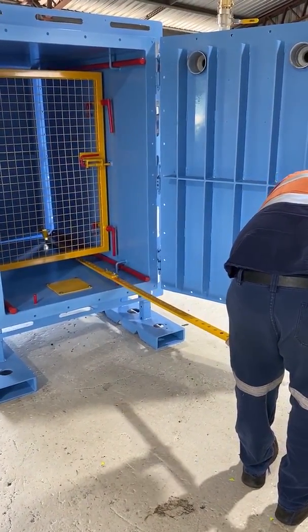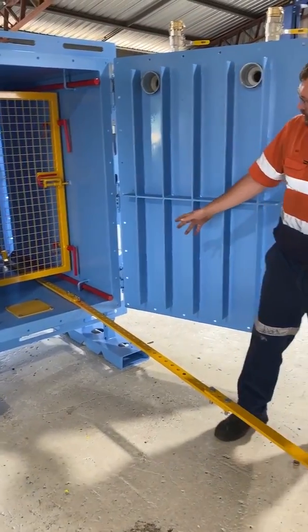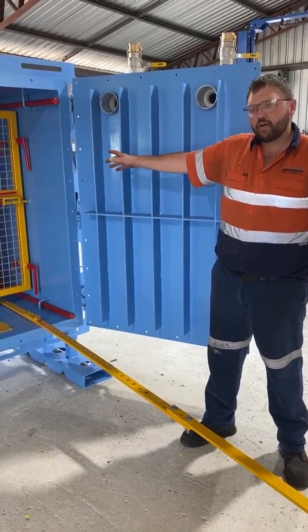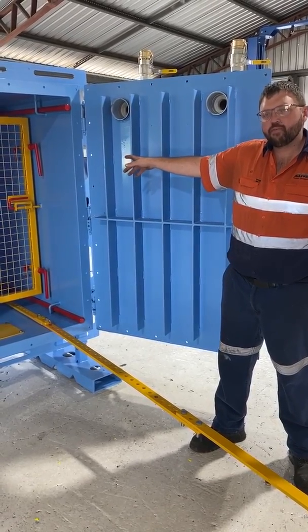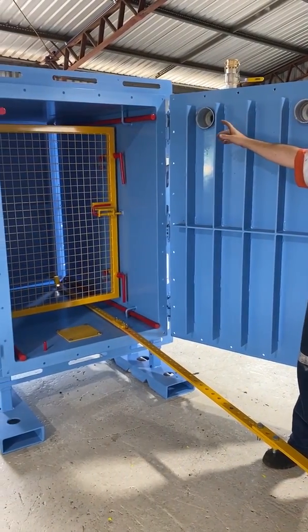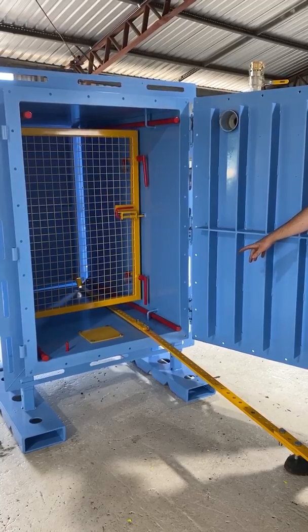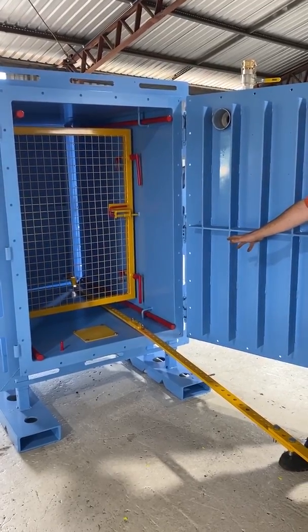By lifting the extension bar off the locked point, we can then easily pull the door closed up to the final hole. The final open hole in this is set up so when it's in this position we have a 50mm opening size in relation to the RHS to the opening point on the back door. We can then re-affix our lock and it is now set up.